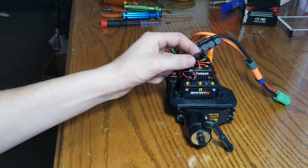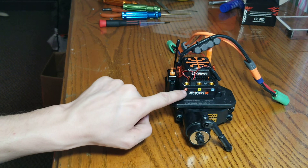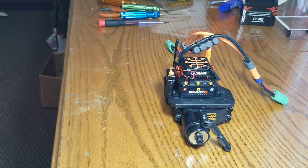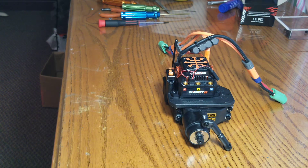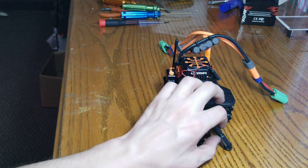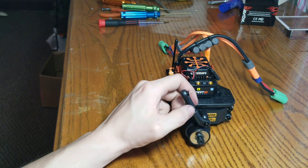Plug in the fan, and then C-B-A or A-B-C for the motor — the motor will tell you on the back of it which ones are A, B, and C. Make sure you get those polarities correct or the motor can be reversed, or you could possibly get an error code on the speed control.